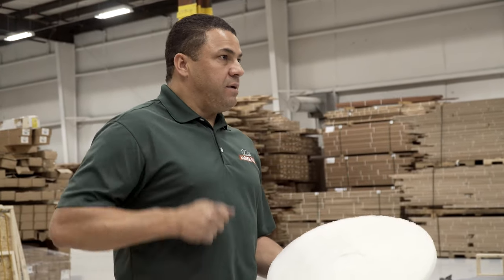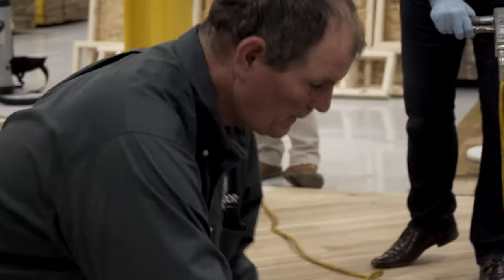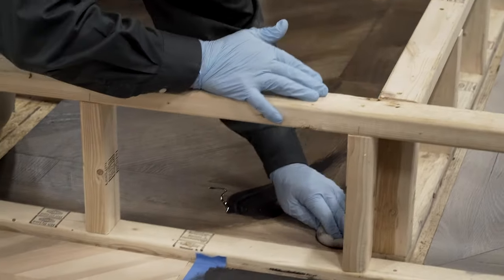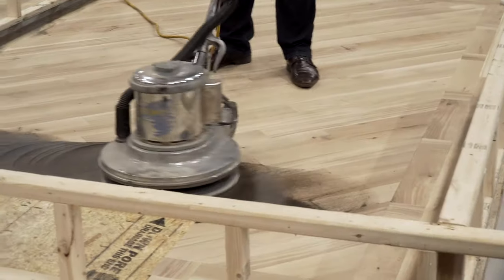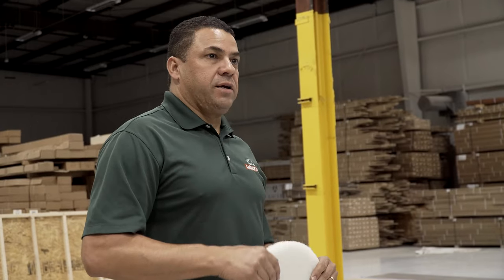When we say get off the excess as hard as you can, you cannot take too much off — until it's dry to touch. The guy behind you is going to wipe off the excess, he makes a turn, and then just keep doing all the edges. After you do all the edges, you're going to make a little pot on the floor, put the buffer on top, and you're going to buff on 100 square feet. If there's one thing I want you guys to get out of this today, it's to work in sections.